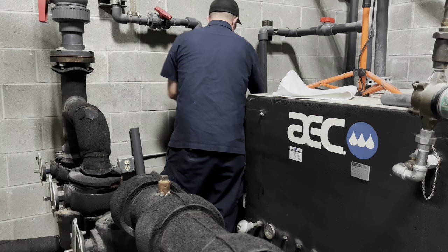Same thing over here on the big 50-horsepower compressor — just hit the on button and it fires up. Over here we have a radiator for the condenser and the air dryer, which works pretty much like an air conditioner to draw moisture out of the air. I'll wait a second for this to kick on — now wait till you see what comes out of this thing. That's all dust — and bear in mind, I do this blowout every Monday. This is only one week's worth of crap, and we're inside. The CFM these things move just collects everything in the air.